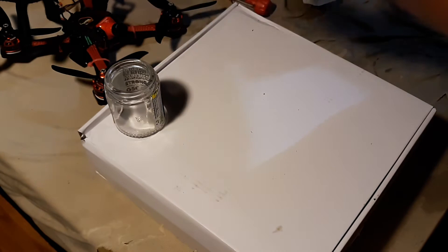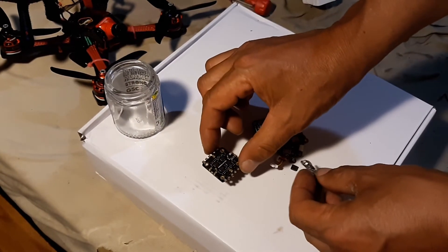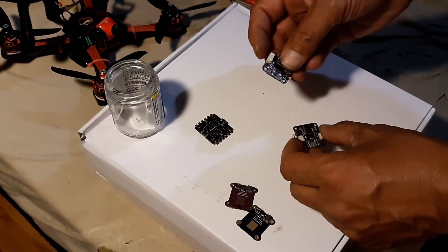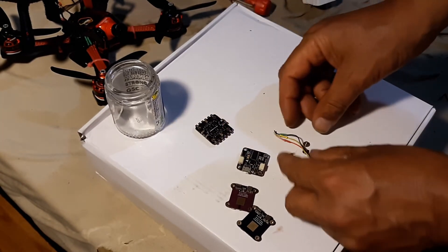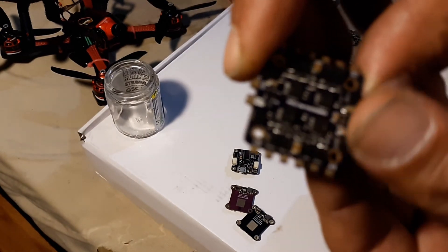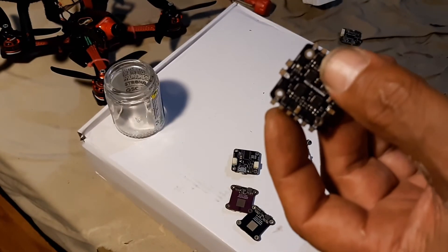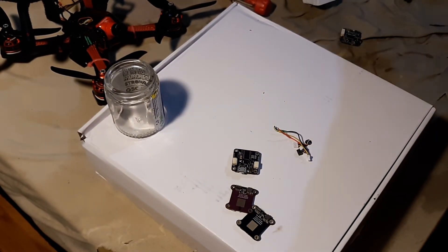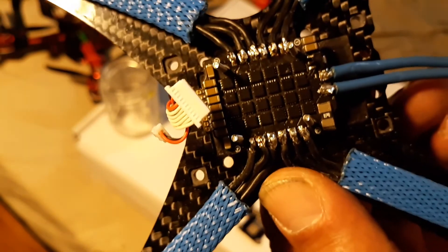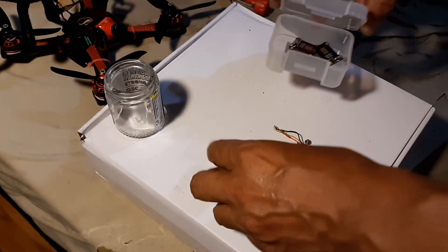Here's all the parts that took to get to this point. There's your ESC. There's VTX number 1, VTX number 2 — well, that's just a spare. Flight controller and wires and crap. I like this one because for beginner solders, the pads are pretty spaced out. Whereas the Mamba, they're a lot closer — check it out, see how close these are? They're a little bit tougher to solder. I didn't like soldering these, it pushes my skills. And they're not that great a solder. It'll work. One piece at a time, right? That gives me an idea.